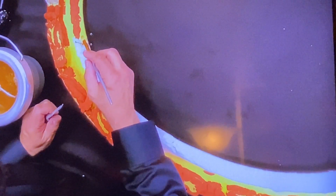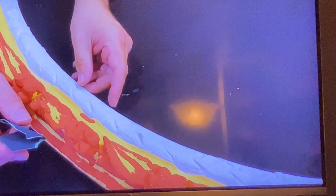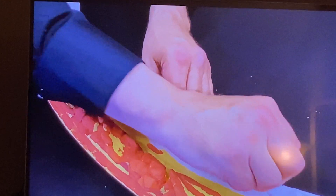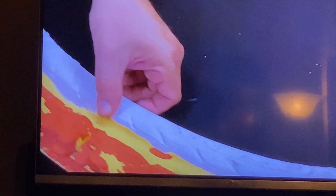I left this segment white — gesso with about 11 coats. Every couple of coats I'll give a light sanding. If I raise any grain with the water, the gesso knocks it back down. Eventually beginning coats will be stippled so they grip to each other, and the last few coats — 9, 10, 11 — will use broad brush strokes. In the end, I'm going to sand with about 1,500-grit paper. In the end this is supposed to feel and look like solid gold, solid metal — that's what we're trying to achieve. We're going to move up to an area I've stippled one coat of gesso on, pull it out of our double boiler, and you're going to see the stippling action — sometimes I'll stipple more aggressively than others.